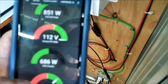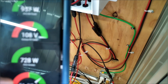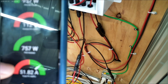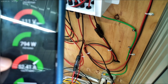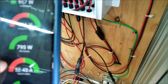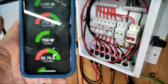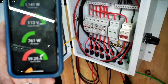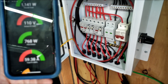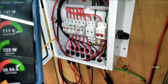As you can see, it's now pulling in at 113, 110 — somewhere in that range, between 110 and 120 most of the time — and that allows it to fluctuate up and down. Whereas before it could not fluctuate. What I'm assuming was the problem is that because it could not fluctuate, it had to stay at 61 volts. It was showing me 61, but yet it was just eliminating power that it couldn't pick up because the voltage was too low.